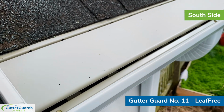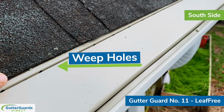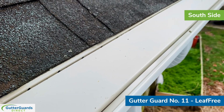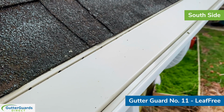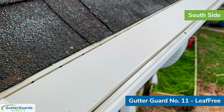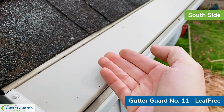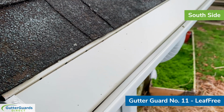You can also see that this one has a series of weep holes, so this upper line of defense serves two purposes. If you have slow-moving water just kind of trickling off the edge of the shingles, if your shingle is behind that weep hole, then it can act as the first line of defense. If the shingle overlaps the weep holes, it will prevent water from wicking back upwards and going up under the shingles. So it's a good design system.